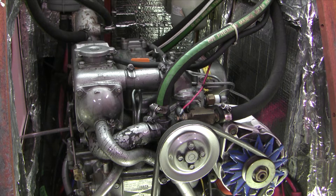Some of you will notice I've left out draining the heat exchanger for my potable water. Most of us don't have a spigot at the heat exchanger for draining coolant, so the standard way of replacing that volume is to remove the two hoses at the water pump and flush the length of tubing from one end, capturing excess from the other hose in a bucket for recycling. If you do it, after flushing I would refill the heat exchanger with coolant directly through one arm of the tubing to clear as much trapped air from the system as possible. Trapped air is the greatest risk of a coolant swap — it isn't uncommon for a novice to kill an engine by incompletely refilling. Pockets of trapped air can migrate into the pump, cause ineffective pump performance, and further migrate to the cylinder wall causing superheat damage.